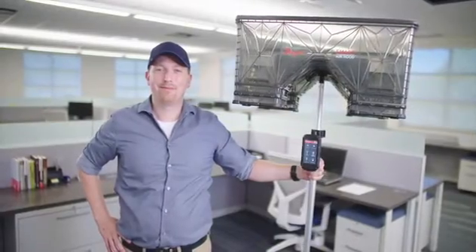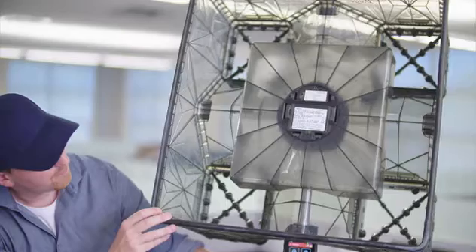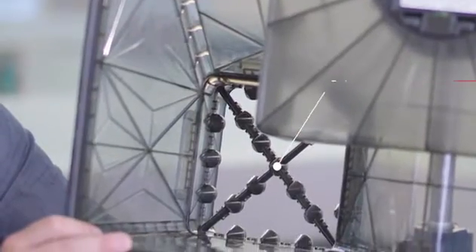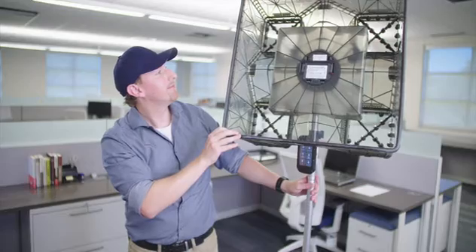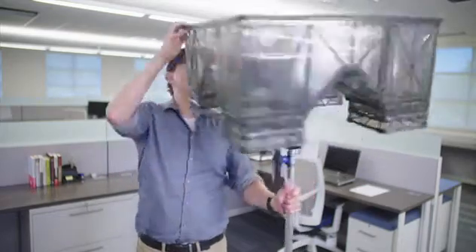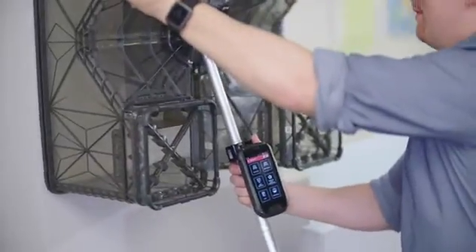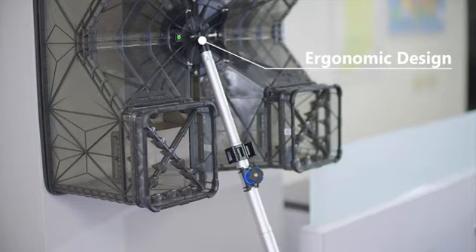As you can see, the product holds radical design advancements. The pitot arrays are arranged using Dwyer's Quad Flow Technology. This eliminates back pressure placed on the system during measurements. By using this technology, it also enables the Smart Air Hood to retain accuracy regardless of the style of diffuser. Whether it's a ceiling or sidewall register, the pivoting pole mount allows you to ergonomically position the Smart Air Hood for almost any situation.